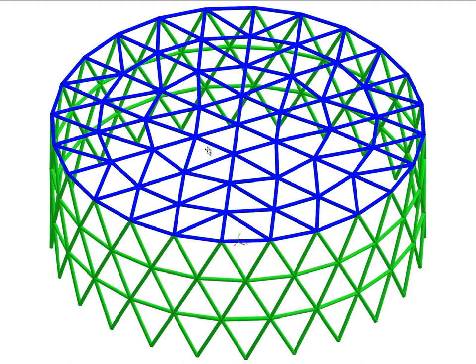So conceptually, I want you to imagine the following logic. On a dome, we have a continuously evolving surface, which might start off vertical for a hemispherical dome. It starts off vertical down at the boundary, and gradually keels over and the angle changes, and it goes from being predominantly vertical to being more horizontal than vertical. So in the portions that are more nearly vertical, we're going to apply a lamella pattern. In the portions that are more horizontal, we're going to do a pi sector pattern.